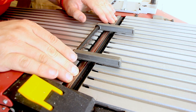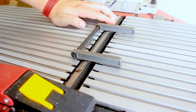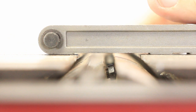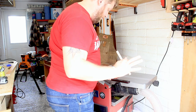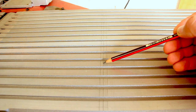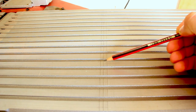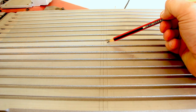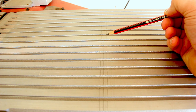Line it up — you can see you've got a little gap and a big gap; put the big gap over the blade. This is just the initial set, so you're going to rotate that one and it should go close to the blade but not actually catch it. As you can see, close to it but not actually touching it. Now the first thing you want to do is draw three lines — these three lines are crucial: a central line, one in front and one behind, five millimeters apart on each side.